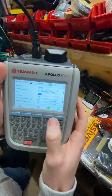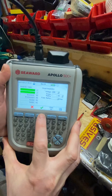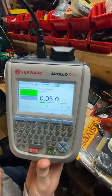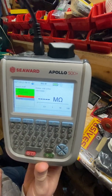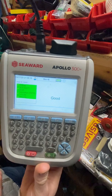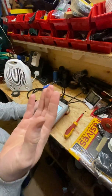We'll carry out the test by plugging this into the machine. The machine will first ask us to confirm we've done the visual test, then we save and proceed. The first test it carries out is the IEC earth continuity test — that's a pass. Then it carries out an insulation test — that's a pass. And then, importantly, it carries out a polarity test as well.